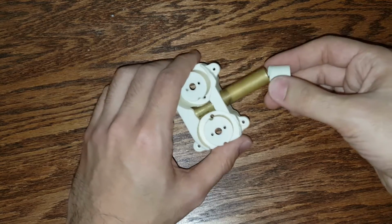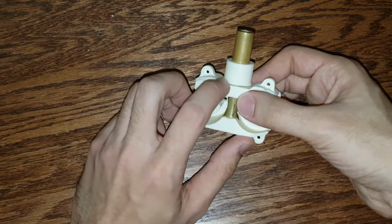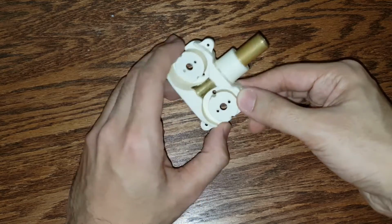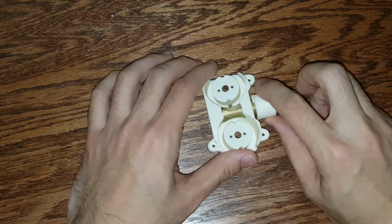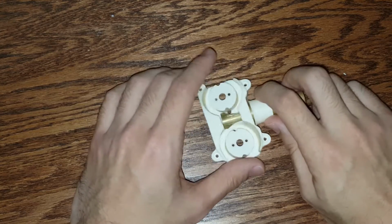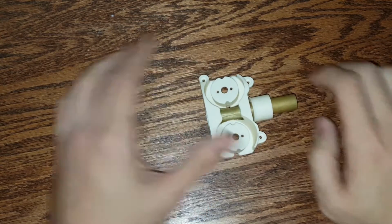Then you take your barrel spacer and put it on top. The little flange right here, it kind of flares out a little. Make sure that's towards your cage. And then that is your assembled piece. It'll sit flush. Right now there's that little flashing that I haven't cut off. But yeah, that's pretty much your assembly guide, and it's really that simple.